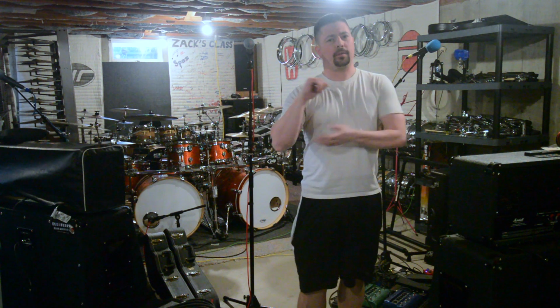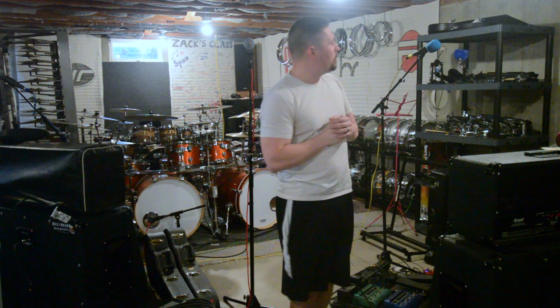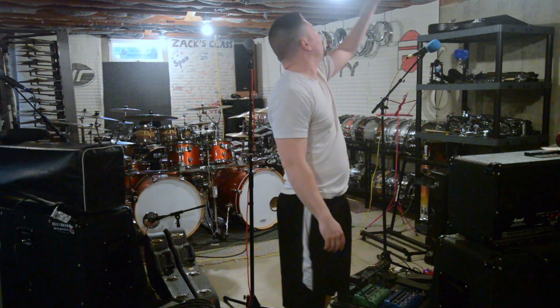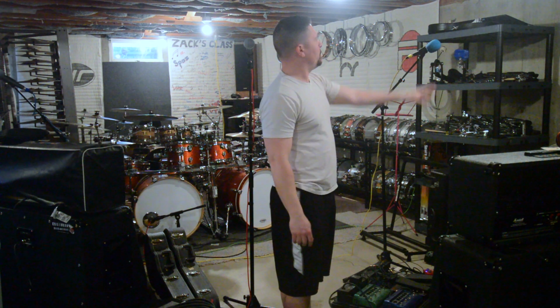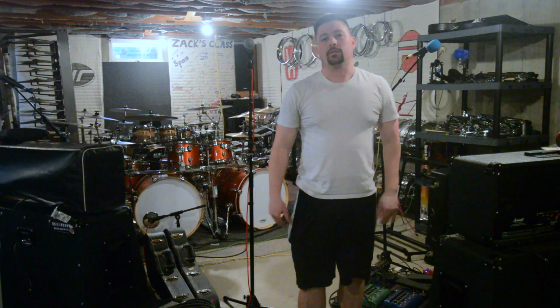I don't know how many parts this video is going to be. It's obviously going to be several parts. But today and yesterday I brought home some rigid foam insulation. My goal is, I've already started putting up sound insulation up into the rafters, but I'm going to put rigid foam insulation against the walls, and I'm going to put them in the joist there, and basically try to get some of the heat.